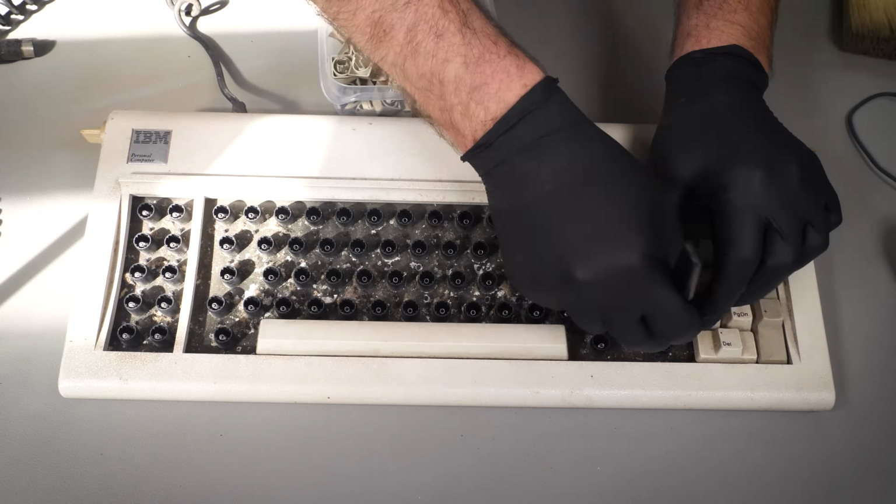It's a mechanical keyboard. It uses a buckling spring over a capacitive PCB, and it's held in high regard in certain circles. The later Model M keyboard, I'm told, uses a membrane instead, and the purists like the F over the M, but I'm sure there'll be plenty to fight both corners on the keyboard front.